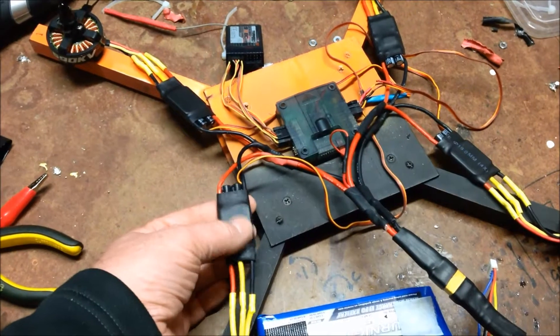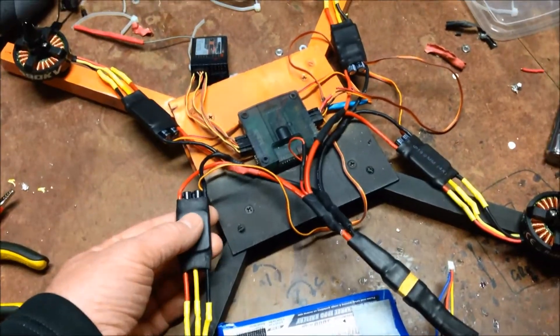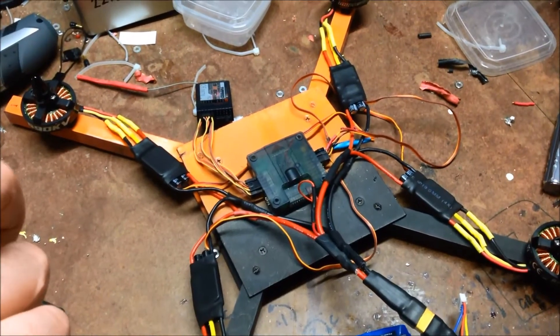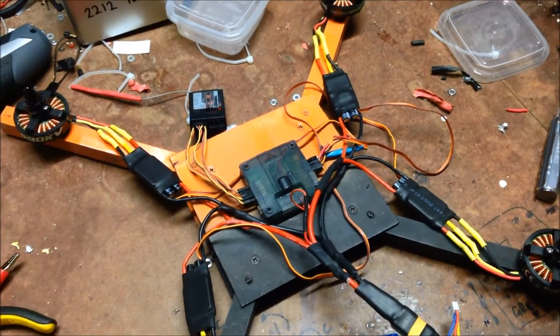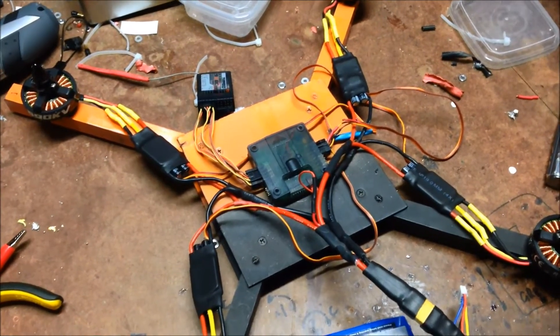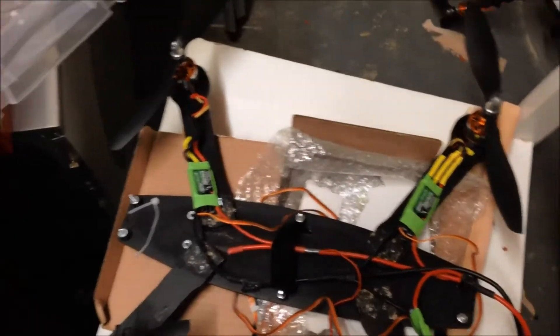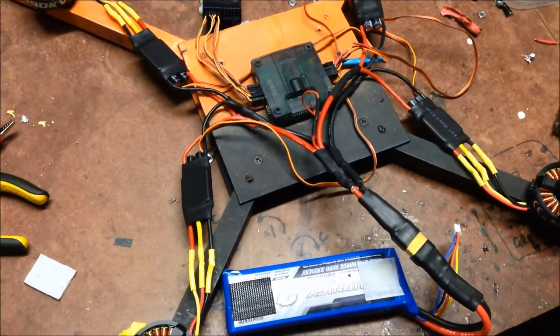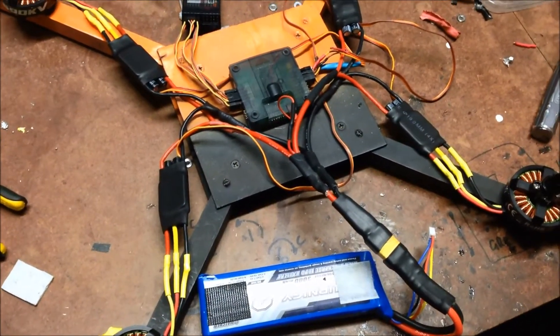One of the FETs or whatever they are — there was what looked like solder on the inside of the heat shrink. Anyway, my mission now is I have three Multistar optos left, and I need to find a version of SimonK firmware that will work with them to get this thing flying. Let's see how we go.